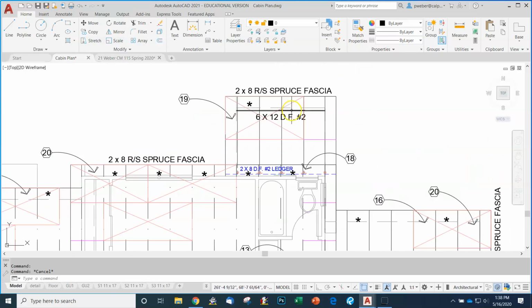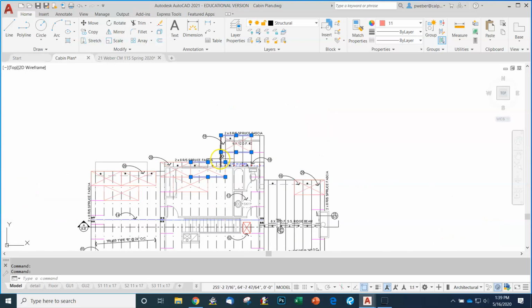Now the porches, front porch and back porch, they have a 4x8 sheet of plywood also, and 1 foot of it is going to be cut off. But this distance here on the slope from here to here is 48 inches. But the distance on a slope for a 4/12 slope or a 3/12 slope, say 4/12 slope, is more like 40 inches. So offset these, did I do that right? No, I did that wrong. Offset these two lines by 45 inches versus offset the steeper roof from here to here by 40 inches. Yeah, that'll take care of it.